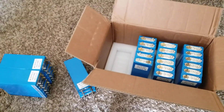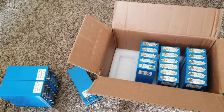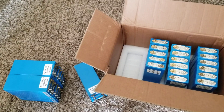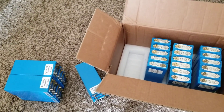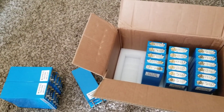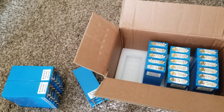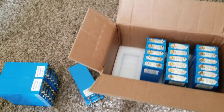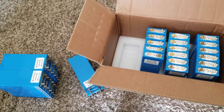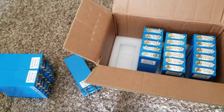You can see all the batteries are sitting flush — there is no bulge anywhere. They're all solid, no bulging at all, which means these batteries are brand new and in good condition. If batteries are bulging, that indicates problems. They can still work, but you have to be careful how you balance or charge them; charging to the brim with bulging batteries causes a lot of problems.